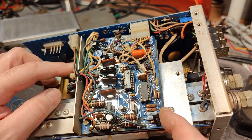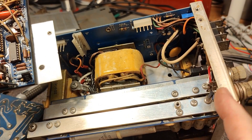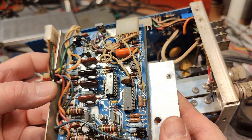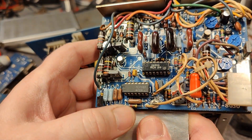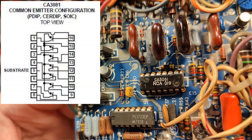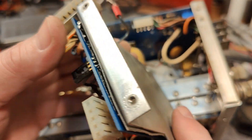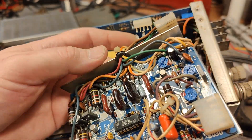Let's see if we can get that one out. The positive output is connected to this aluminum frame and also connected down here — you can shield with either part. So what have we got here? This is our MC1723 and CA3081, and just a few transistors. I don't see anything burned or broken, really, at least not from the visual.